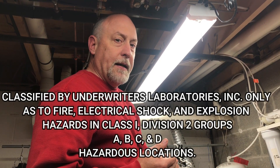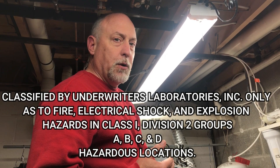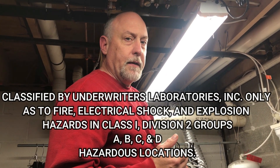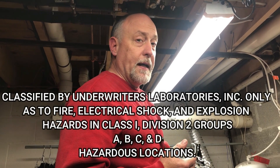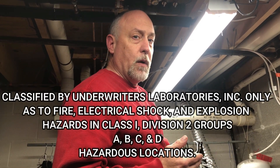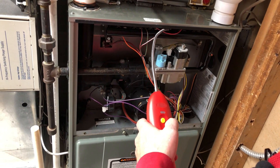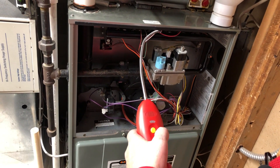The EL320 is a really good product that can't be beat when it comes to cost and also sensitivity. It's intrinsically safe, so you can use it in explosive areas — just an all-around great product. If you're doing any work around gas furnaces, this is definitely something you want to consider. Another thing I do with this quite a bit is, when the furnace is off, check at the outlet of the orifices — make sure the gas valve is fully seating and closing. Another great use for that.